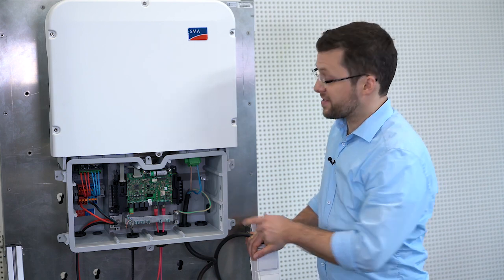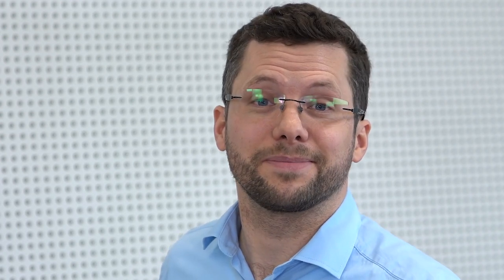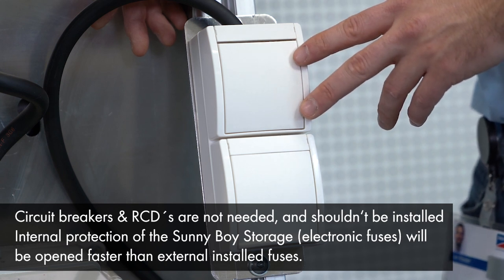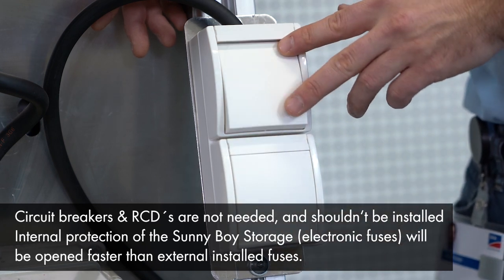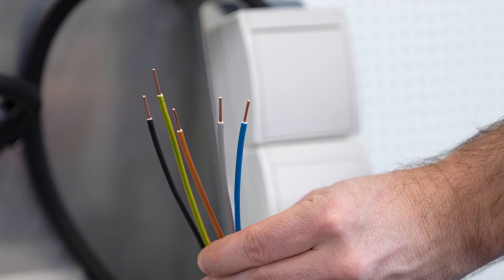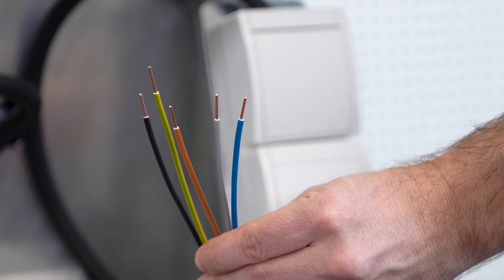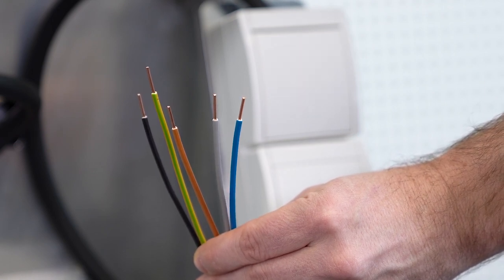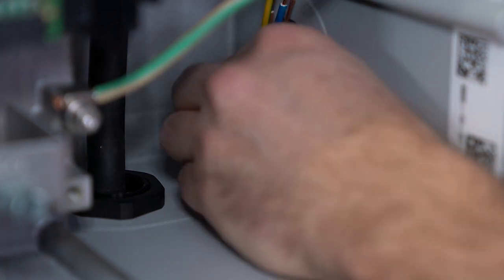The new Sunny Boy Storage comes equipped with secure power supply. This means that even during grid outage you can power a socket. If you need guaranteed power supply without any comfort losses you can select our optional battery backup boxes even as a retrofit. In our system we use the secure power supply. I have already mounted and wired a surface mounted socket with an additional standard switch, for example a light switch. The switch is necessary to enable the secure power supply. In general you need a 3-wired cable for the AC secure power supply connection and one 2-wired cable for the switch. In our example I chose only one 5-wired cable with the right cross section to reduce wiring efforts. Please insert the cables through the intended cable gland and connect them to the plugs.